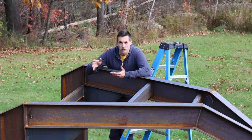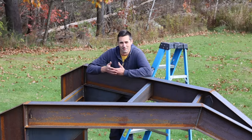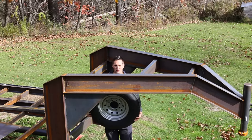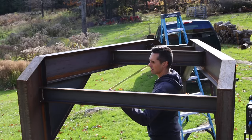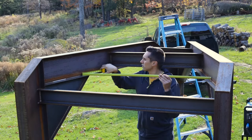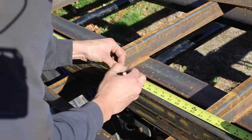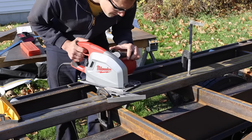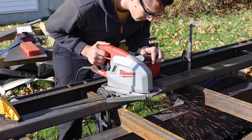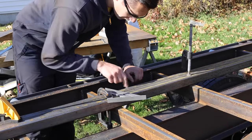The first thing I'm going to do is work on the spare tire mount up here because I need something to bump my head on while I'm building the toolboxes. The spare fits in between these two cross members here, so I'll just center it. Got about 35 and a half inches between the two, and at its shortest point it looks like it's going to be about 50 and a quarter inches. That's beautiful, right on the line.